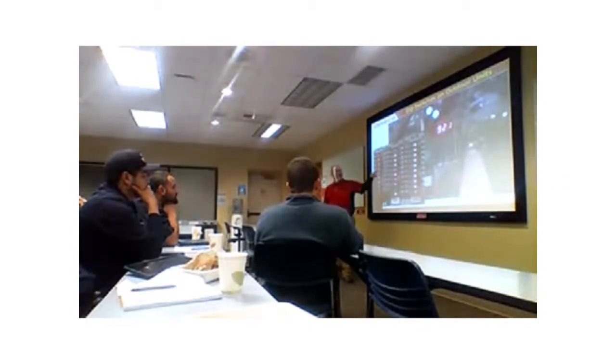But by turning on SW6-10 and then setting the dip switch combinations for whatever function you want to set, then press the little red button. There's no explanation on the board of what it does. This is what it does. Once you set a function number, the function number shows up on the display.